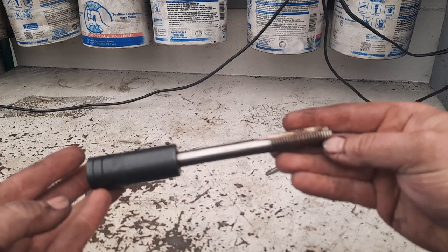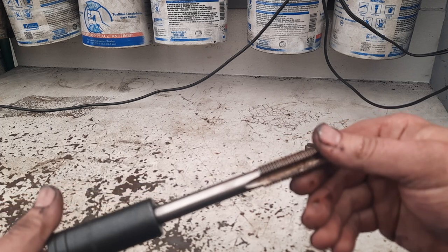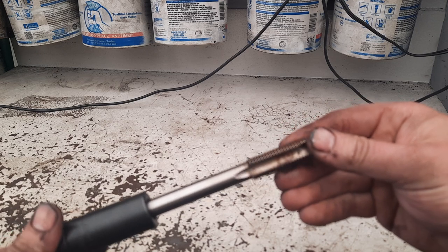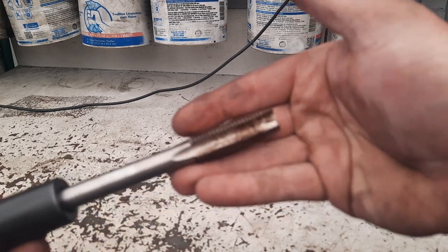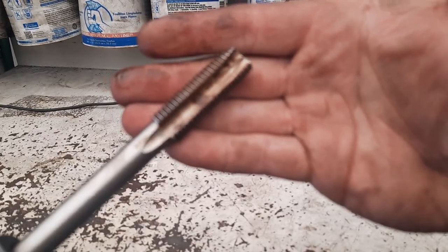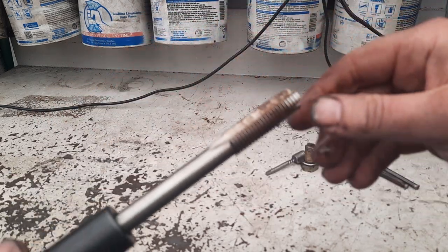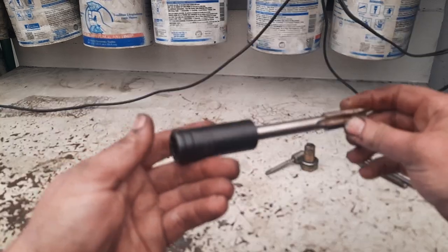It's a good tip when putting in a replacement transmission on a different truck. It was a rebuilt one — they bought it outright — and there's no room for the side mounts, so I went ahead and tapped out the holes. I'm glad I did because there was a lot of debris still in them, and of course they painted the holes. There's really not enough room — you don't want to be wrenching those things in the hallway.